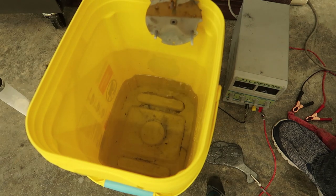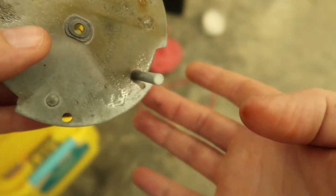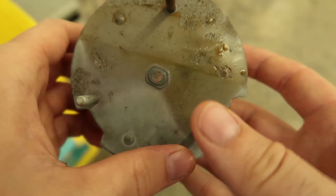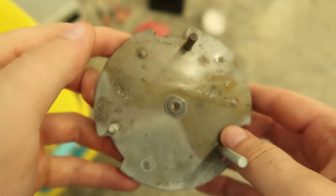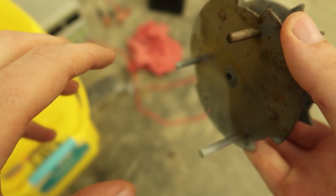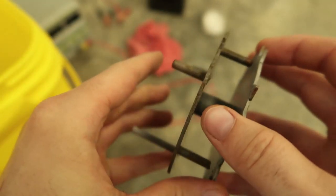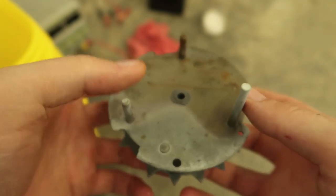Interesting — I just washed it off and there was like a red, almost rusty-colored layer, but that came off relatively easily. Unfortunately, the parts that were not submerged rusted up very quickly. We can see some plating going on here. That was over 45 minutes, so I might want to increase the amperage or voltage. I also want to rotate it, because this side was facing the anode and this side was facing away. It still had some plating but obviously didn't get very much. I should probably totally submerge it and rotate it somehow — maybe just take it out and put it back in repeatedly.